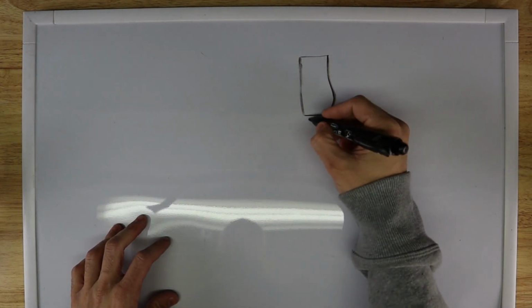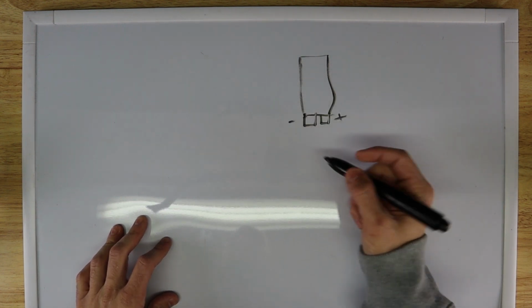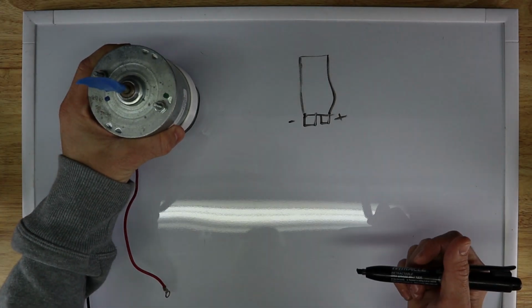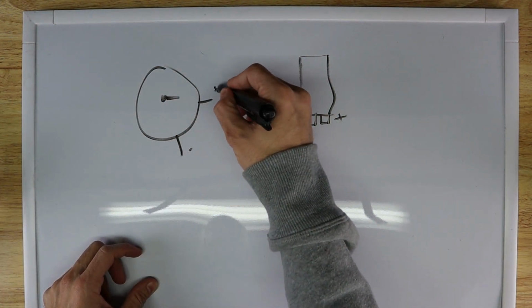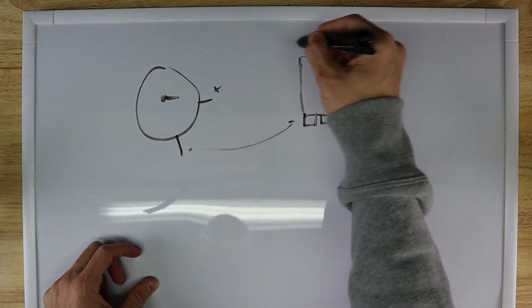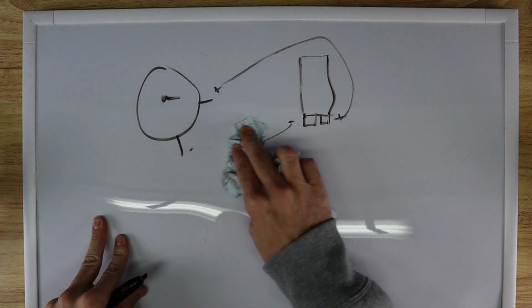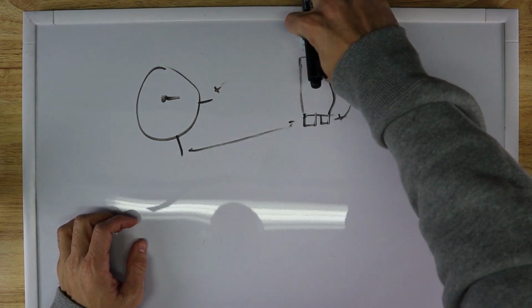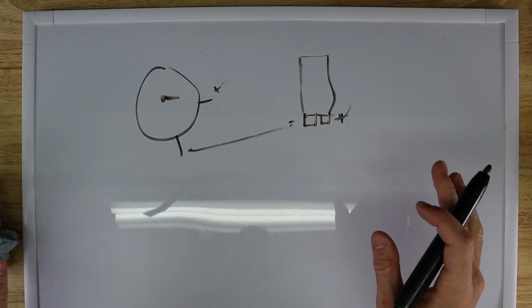So we've already shown what happens when we take the battery negative, positive to our motor. That's the view of our motor from the top. And we stick our negative and our positive ends together. This thing spins. So what we need to do is put a button in front of that. So actually we're gonna leave those negative wires together and we're gonna interrupt this positive wire. Now you could do this on either one, it doesn't matter.